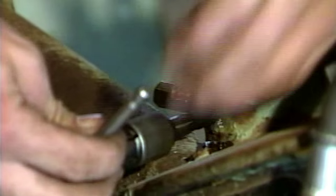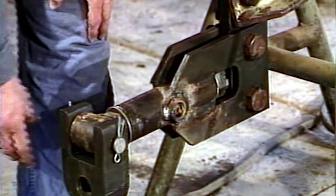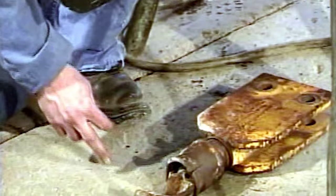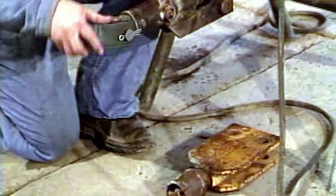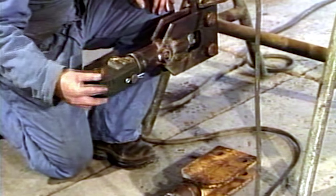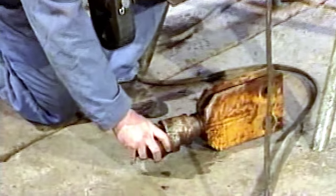This is the tongue, the hitch unit. This is a universal hitch. The main difference is between this and the old style bulldog hitch, which you can see here. This universal hitch will swivel up and down for going over rough terrain, where this old hitch is a solid hitch that just hooks on solid.